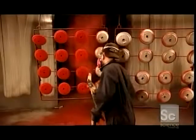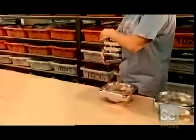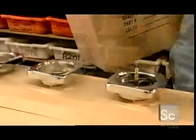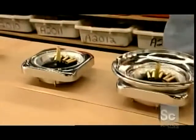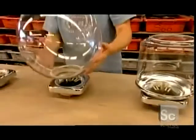Now they spray powder paint onto the lids, giving them a coating that's almost 1/16 of an inch thick. They bake the paint onto the lids at 400 degrees Fahrenheit for 25 minutes. Now it's time to put all the pieces together. They place the dispensing wheels in hoppers, then cover them with a part that stops free gumballs from spilling out. The next part is the adapter ring, and the plastic globes fit on top of them.